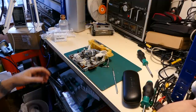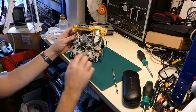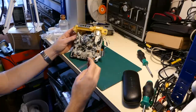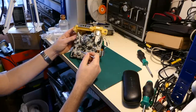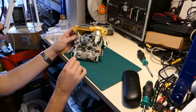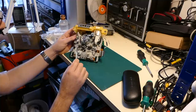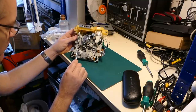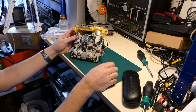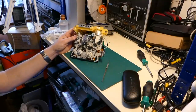Now here's the nuisance factor. Both of these spools have a complication associated with them. The supply spool, if anything, is the worst, because you have to take this back tension band off. And that will mean resetting the back tension. And I've just noticed I've got markings on there. I've done this one in the past. Let me zoom in a bit and you can have a look.